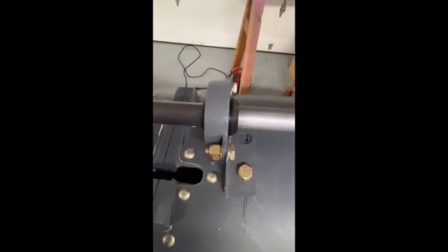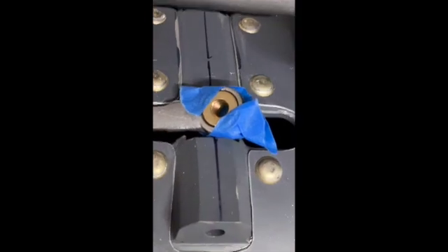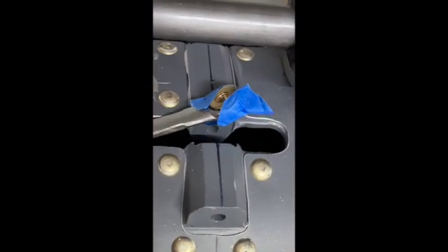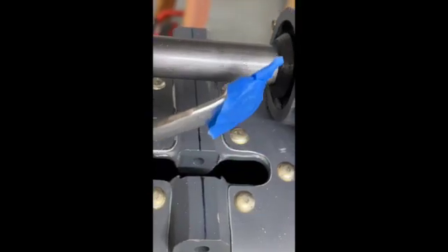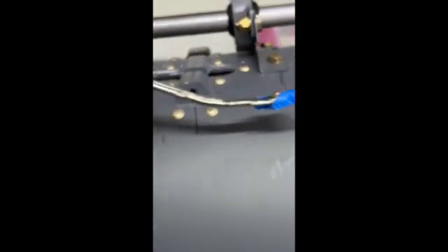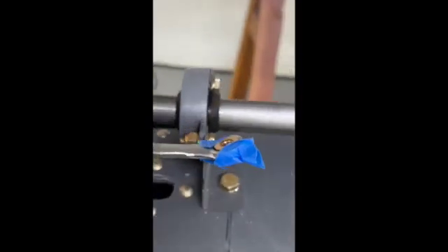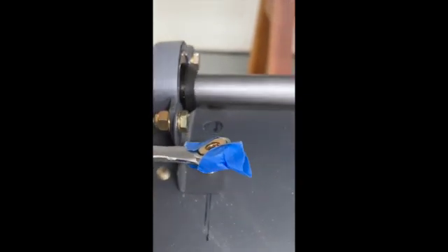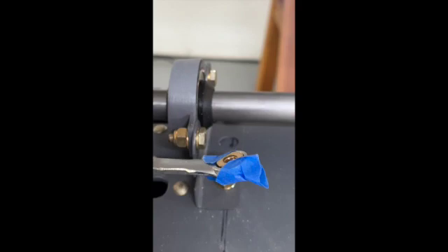That bolt — and the way I did that, if you look at this wrench, I'm going to try to zoom in here so you can see it. I just taped the nut and the washer into this wrench so it doesn't fall out. With it bent at an angle you can see it's perfect to get it in. And they actually worked on the first try for each bolt. So now I've got another modified wrench — who knows if I'll ever use it again — but it worked and it sure beat making an access panel.